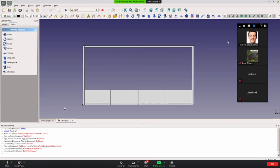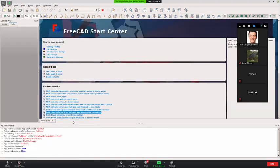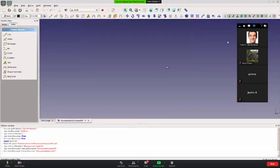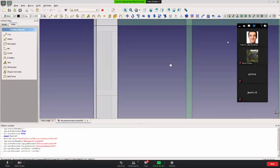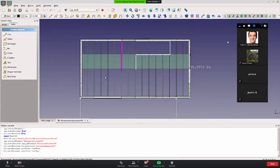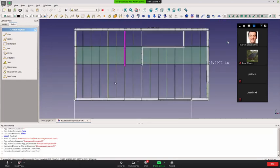And here you probably want to start by locating against the first and second floor locator sketches, when we're doing the CAD master file. There's the sketch, so that if you're at 0, 0, when you put this into your final model, it'll actually be positionally correct. But you can work it on the first floor or on the second floor already. Okay, so this is the master file. I see. So I can use the joists in the wall modules here to make sure that the panels overlap with them.